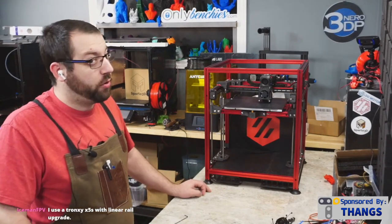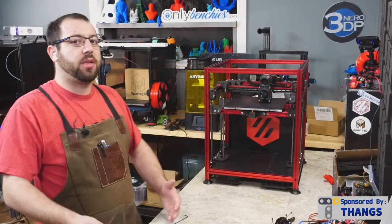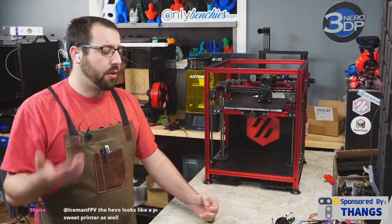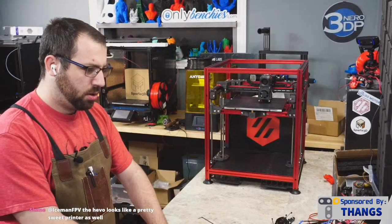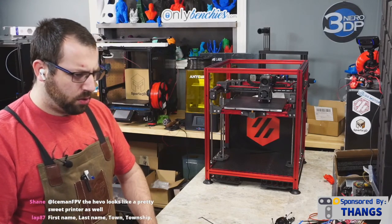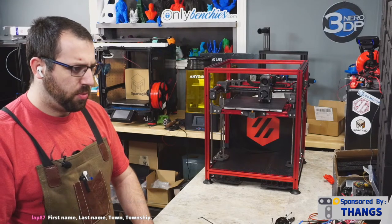There are configs for that. They're for a different controller board, but the config is there. So what we're gonna do is take that Voron V1.8 config for probably the SKR 1.3, and we're gonna go through and modify it to make it work with the SKR 2. But before we do that, we gotta flash the SKR. So, let's connect to Toasty Boy with PuTTY.